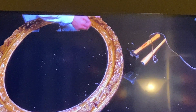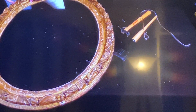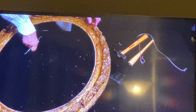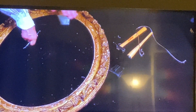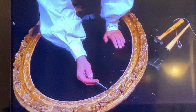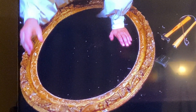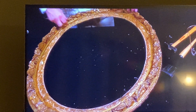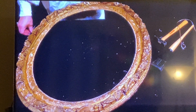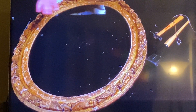Flipping the frame over — these are where the triangular areas were. These lines are part of that triangle, and the long grain is breaking, which is item number one to address with hide glue. Next we're going to take the frame apart. To do so, we'll need to remove some ornament that bridges over the cracks — these are going to have to be popped off sympathetically with heat and gentle prying. That will give us the frame essentially in four pieces. At that point we'll deal with the triangular pieces, pulling them out, re-gluing, re-adhering, putting the frame back together, and then moving on to cleaning. Next time we'll have all the components on the table to show how this goes back together.